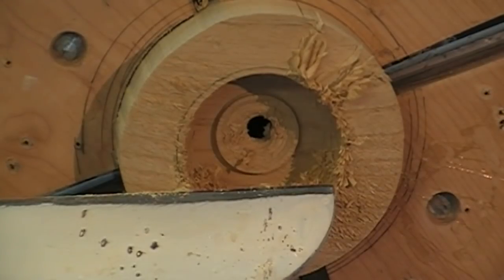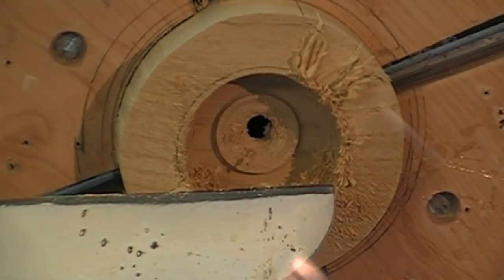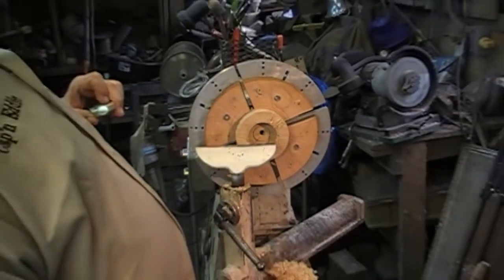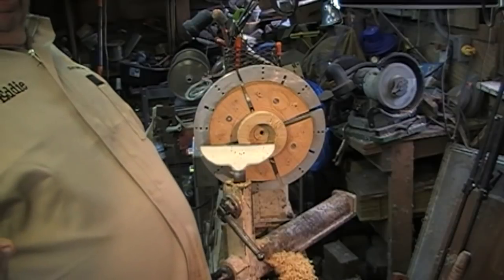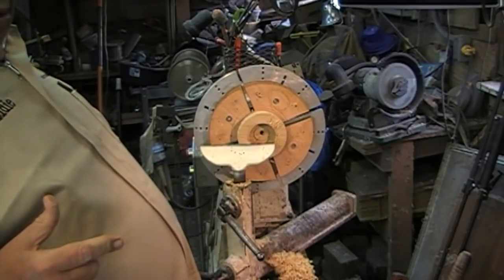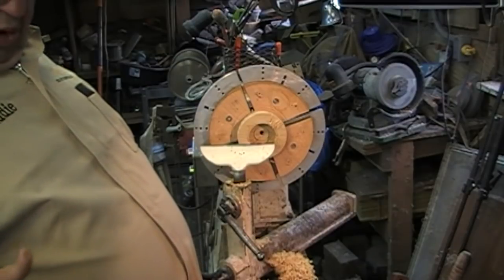As you can see, with a large bedan, I can easily reach down in that thing, being an inch and an eighth deep. With a smaller one, there'd be a little vibration, but if I take small cuts, I can get it done. But I'm getting started on it. Moving down in, I've got a little problem with camera positioning in this studio. I lost some parts, and I haven't got them made yet. I've got some boys coming tomorrow to help me with making up some parts and pieces. I'm not permitted yet to do steel work.